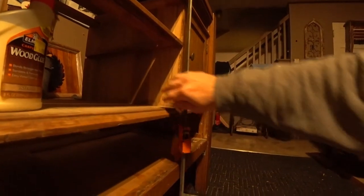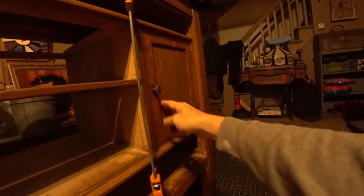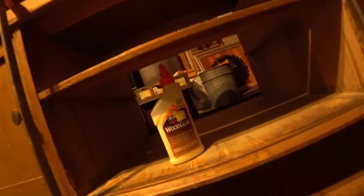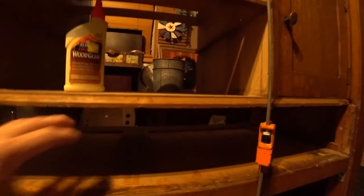this inside piece that makes up this cabinet, along with the same thing up top, had the whole front end sagging down. You could see the nails in both places where it was sagging down. So basically what I did was I glued it in both spots and then clamped it so that this pulled up, and now this bottom drawer will actually fit.